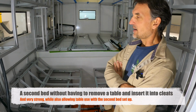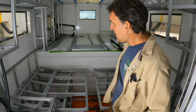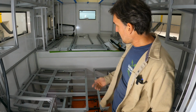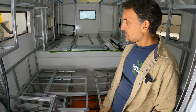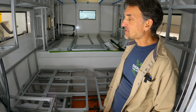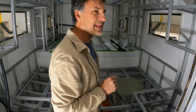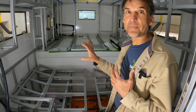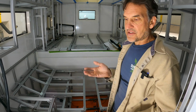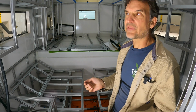This bed right here is about 76 inches across. Now these slide out and voila, you get yourself a secondary bed. Of course it's going to overlap a little bit here, filling in this gap. But then these just electrically go up, so you just push a button to give it the reclining position that you want. The way that I built these is that there's one linear actuator per side, so I don't have any synchronization issue between the two. The one will handle the load perfectly fine.